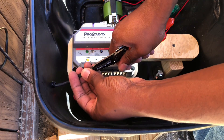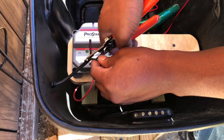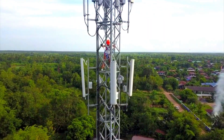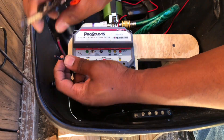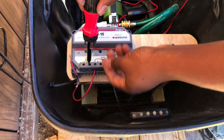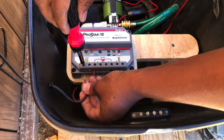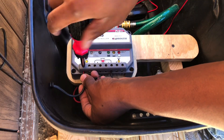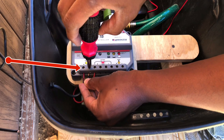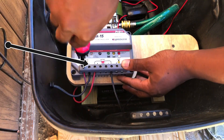Next, I began working on preparing the solar wire connections to connect to my solar charge controller. Since I was dealing with a fairly small solar panel, I did not take the extra precautions usually necessary while working on electrical power — but if you are new to electrical work, please consult with an electrical professional. To hook up the solar panel to the solar charge controller, I just needed to connect the red or positive wire from the solar panel to the positive solar connection on the charge controller, and the black or negative wire to the negative solar connection.